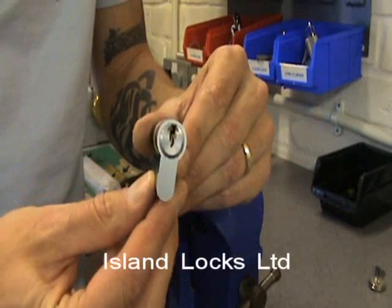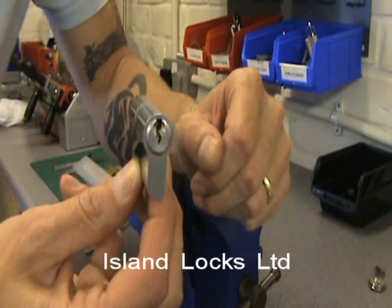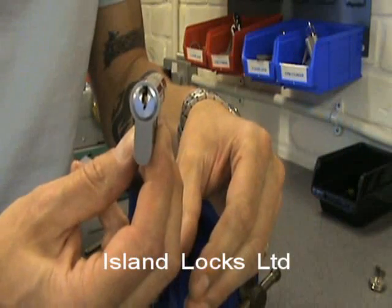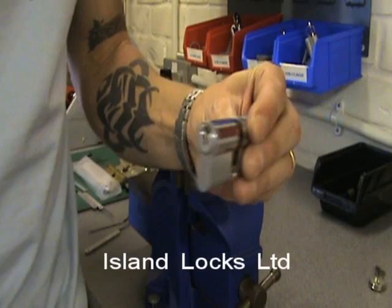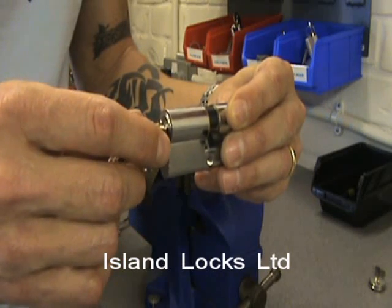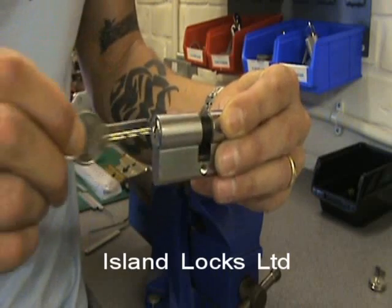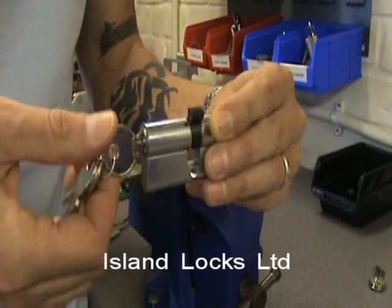What I'm going to show you now is something we get asked quite a lot, with reference to Euro and oval profile cylinders that operate a cam. Some people find they may get a job where someone's got this type of lock, whether it be on a UPVC door or to operate some type of deadbolt. They shut the door, pop the key into the lock, turn it, and hear the bolt throw and lock off the door. Perhaps on a UPVC door they try the door handles and it's all locked off. But they find they can't get the key to turn enough to actually get the key out of the lock — it stops just before that, retaining the key. The only way to get the key back out is to actually unlock it.